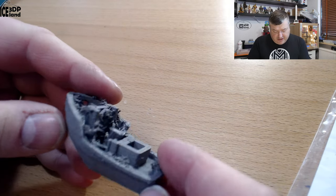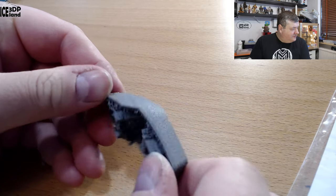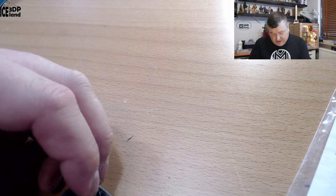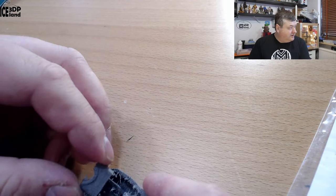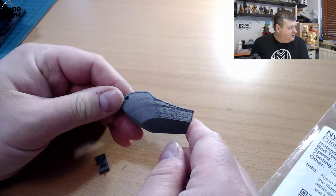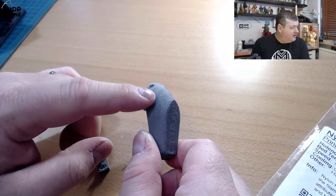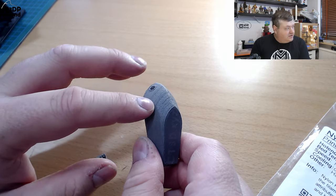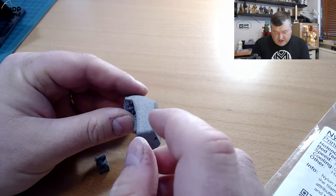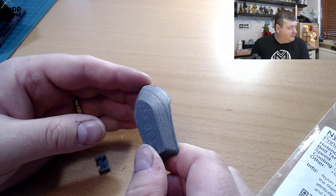And then the Benchy — here I also ran out of filament. You can see on the side it's somewhat rough. I was just trying to break this part off and it was quite difficult, so layer adhesion for this filament is quite good. It was difficult to break. You can see the underside — there was no cooling on the filament, but you can see the rough surface. I don't know if this is a temperature setting issue or what it is. Maybe it could be because the filament was not dry, and this could be smoothed out if I had dried the filament.